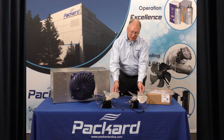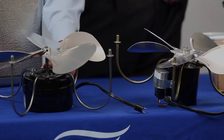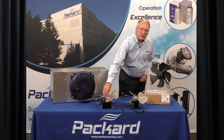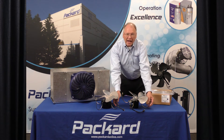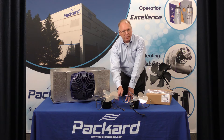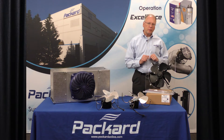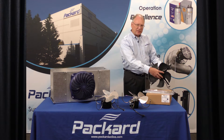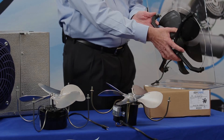The feature is that it's no longer necessary to remove a fan blade, take the motor from the bracket, attach the replacement motor to the bracket, and position the fan blade — hopefully in the right location. In addition, instead of needing a motor for a 115-volt application and a separate motor for a 230-volt application, the new design includes a wide voltage range of 115 to 230 volts. The fan blade is balanced for the assembly, attached to the motor, and the complete unit is attached to the struts for easy mounting within the system.